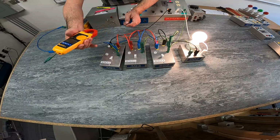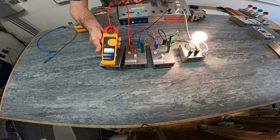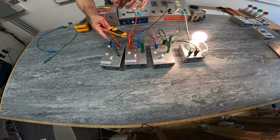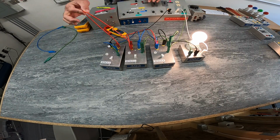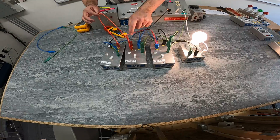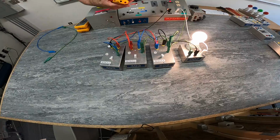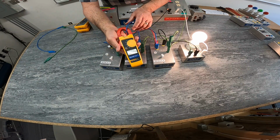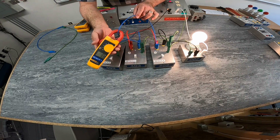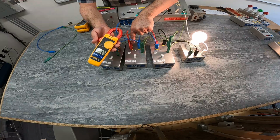This switch I haven't changed position, so it should still be on the red. So I have current coming in on the black of my three-way, going out on this traveler to this location. Originally we were coming out on the red wire to my three-way switch, but now we have current on the blue wire of my four-way. So now there's a connection diagonally here.